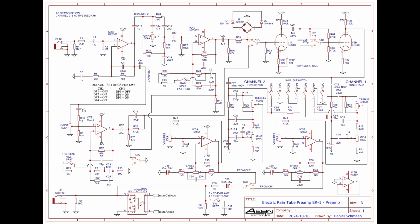When it comes to preamps, it depends on where the distortion mainly occurs. In this circuit, the main work is done by the tube. The ICs are mainly used for filtering and boosting the frequencies. When complaining about these ICs, keep in mind that an enormous number of preamps use ICs in this function. Mesa Boogie does this too. But back to the circuit.